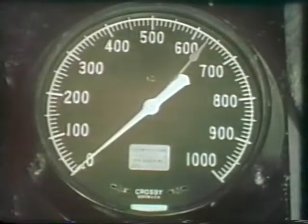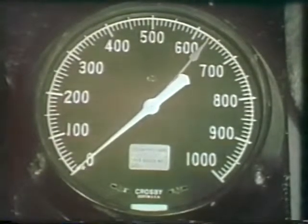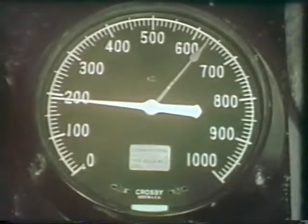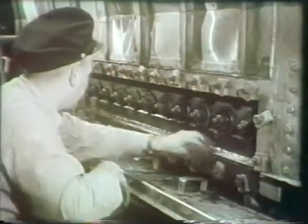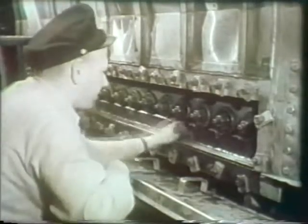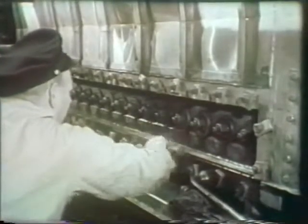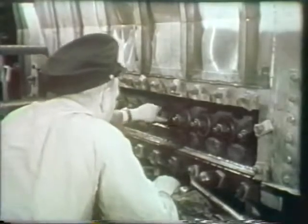With the boiler closed, it is now ready for hydrostatic testing. As the pressure is applied, the gaskets will be forced into place by the surrounding water pressure. However, if a plate has not been properly seated, it will continue to leak. In that event, a slight blow with a hammer may relieve the tension on the gasket, the water pressure behind the gasket forcing it into place.